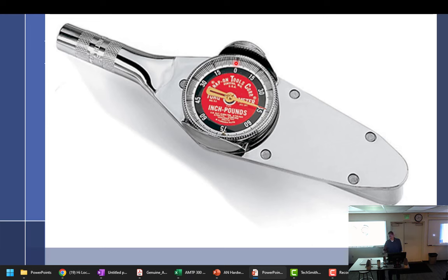Yeah, I prefer to do it the other way, but that is a personal preference. What I do is I set this dial here, I'll turn it around, so 0 is under here, and I will pull it to the number I want. The reason I prefer that is because every now and then you have to calibrate them, and so this needle should not be under the 0, but maybe under the 5 or under the 2, because when you get to, say, 50 inch pounds, the machine may say it's only 48. Then what do you have to do? Adjust. You adjust to 0, so I'd go -2 on it.